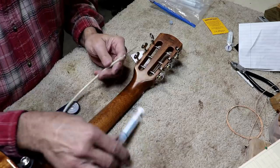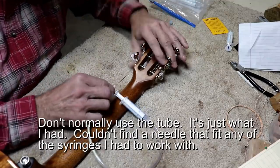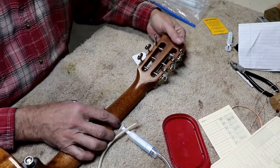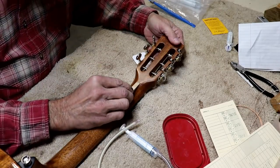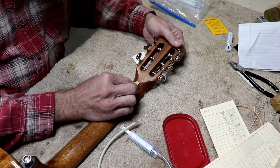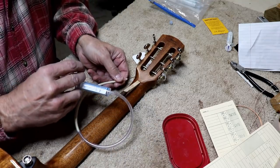I think I've got things about ready to start. I've drawn a bunch of glue up into this tube and put the needle back on after drawing the glue up. I'm going to force this open a little bit — if you push on it wrong you'll break it. The way I do it is I force it open with a wedge. It's easier to keep an even pressure on it with the wedge rather than trying to keep even pressure with your hand. That way the wedge will keep it open, and we're going to see how much glue we can force up in here.